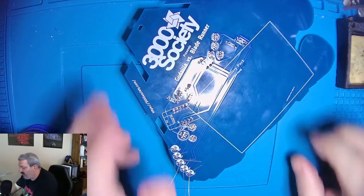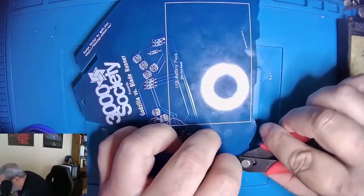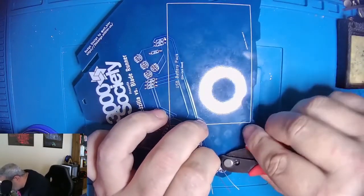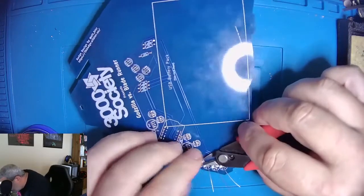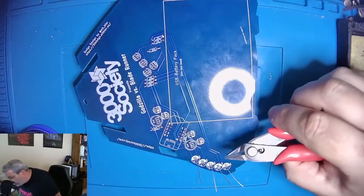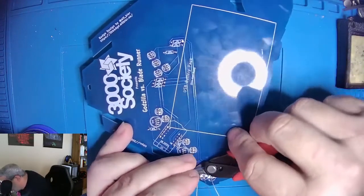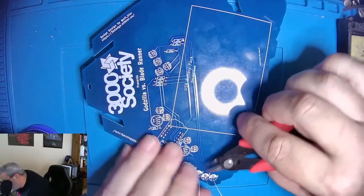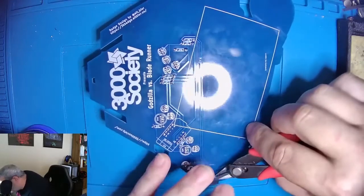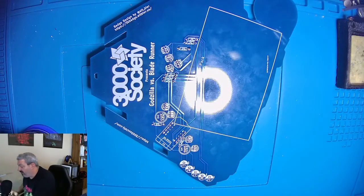All right. These capacitors, they act kind of like little inline batteries where they will receive charge when they're not needed, but if there's a current draw that's greater than the supply on the particular line that they're serving, they will fill the gap and discharge to take care of that current draw. And that was important in this design for the NeoPixel LEDs because they had a large current draw if many of their individual LEDs were lit.